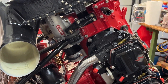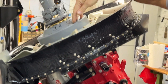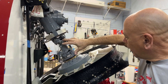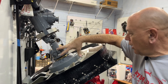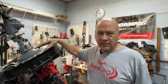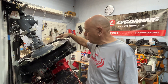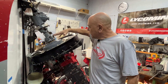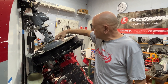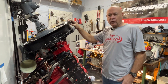So the engine is in, and up here we also have the fan assembly which has the clutch in it — I talked about that in a prior video — and then the coupling. I thought I'd be wise and get ahead, so I hung the engine and put all this together, and then I had to do the bell-mouth shroud. I can't tell you how frustrated I was with myself. All of this had to come back out, clutch apart, a bunch of bolts required new safety wires — it's all back together now after a lot of rework, which I hate.